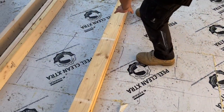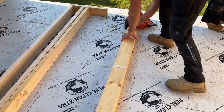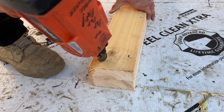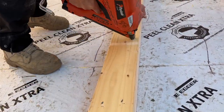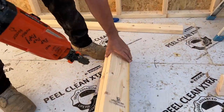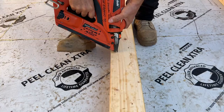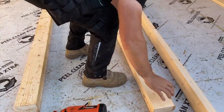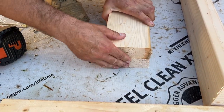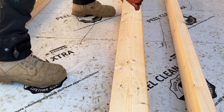These are 90mm nails and the timber is 45mm thick, so nailing them together they shouldn't come out the other side. We're going to put them in at a slight angle. I'm going to make sure it's dead flush and double-nail them, then roll it over and nail it the other way. Do exactly the same for this one — make sure it's dead flush at the bottom and parallel.